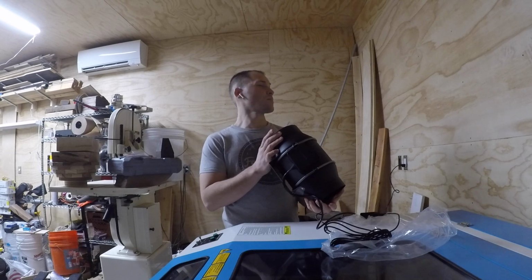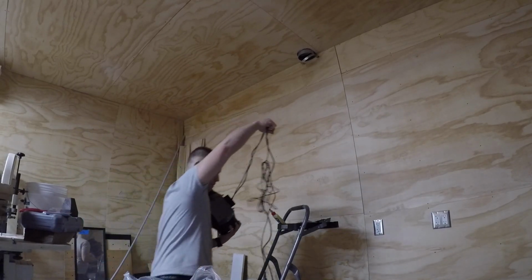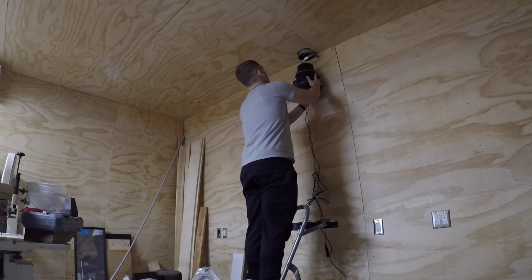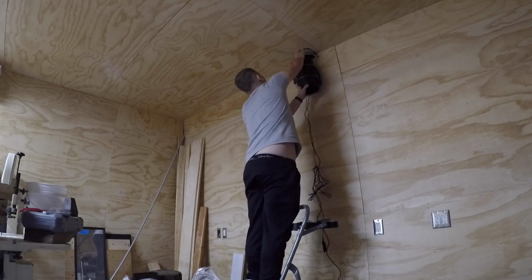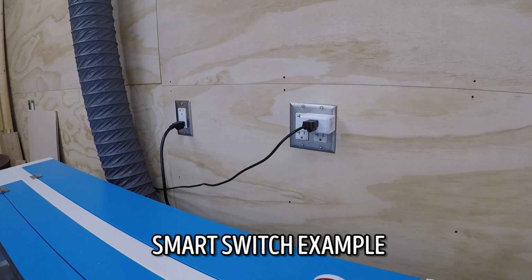This means that if you have your laser control software turning on the exhaust fan right when the cutting begins, you may have some smoke accumulation in the laser prior to the inline fan getting up to speed to suck it out. You can overcome this in a few ways, such as having the exhaust fan have its own switch and simply starting it prior to sending your job.